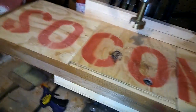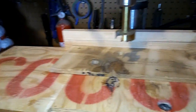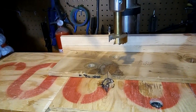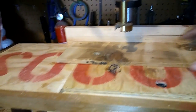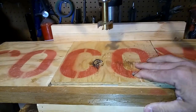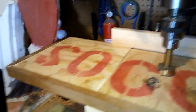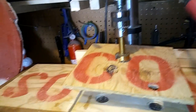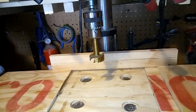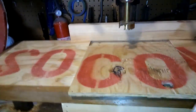I want to make sure that when I do something I have plenty of support to hold it. So I made a little fence back there — I got a little dado edge on the back side of it, and this thing doesn't wiggle at all. It's made out of completely laminated quarter-inch plywood, except for this part. You can raise the press up — there are some lag bolts going on right here — and I can replace this insert as I use and abuse it.